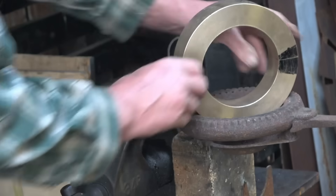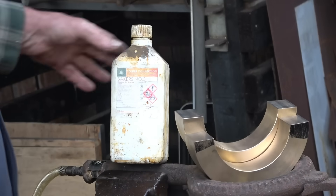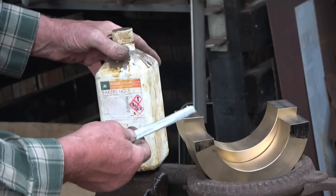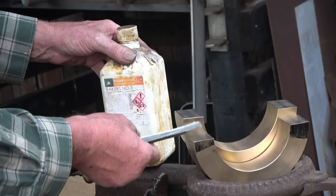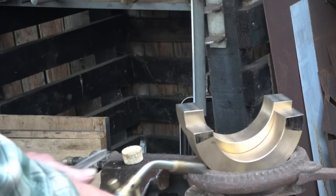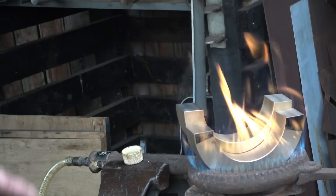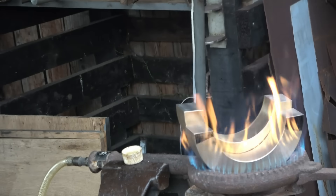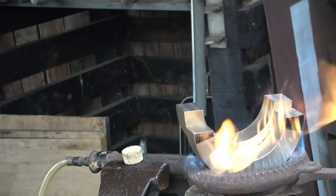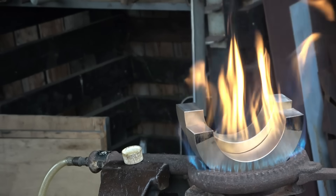I'll get my flux ready. That's the flux I'm going to use — Baker's Number Three — proper solder and flux. I'm going to use tin solder, which is quite a bit stronger than ordinary solder; it's got a high tin content. I'll let this put some general heat in and I have got an oxy-propene brazing torch just to get the local heat where I need it. I'm going to play around with different sized jets so I can get rid of that horrible yellow flame and just have a nice blue flame.